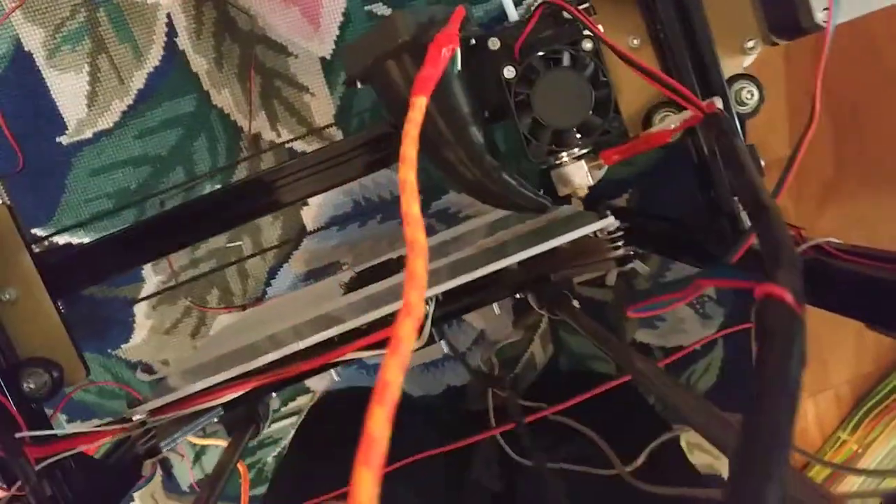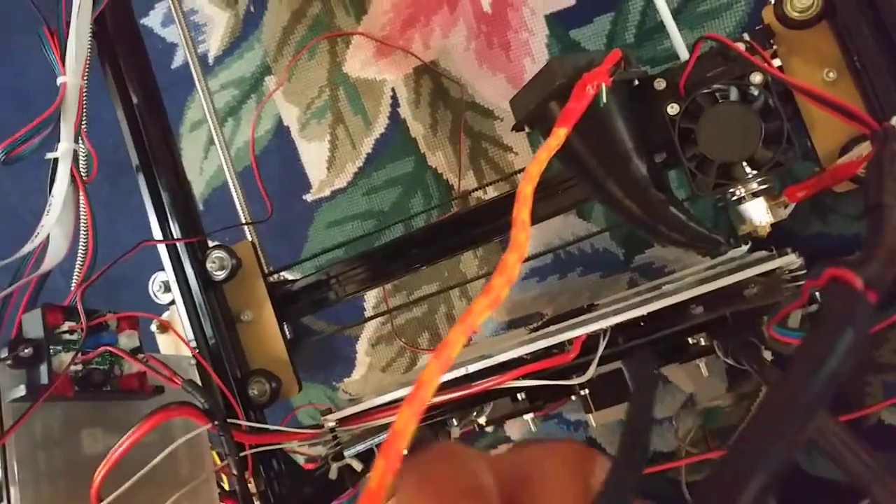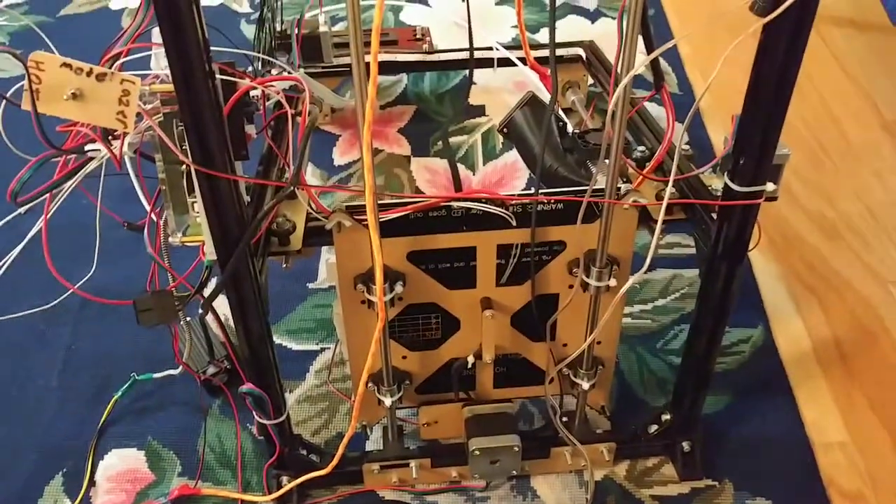When the Y-axis belt — I think it got jammed in the tensioner somehow, because I'm kind of troubleshooting now. Yeah, it's very jammed in the tensioner, I can't pull it through. So it somehow got jammed while printing, and the Y-axis stopped moving and made these awful sounds, and then it pulled one of the zip ties out and jumped across the printer, and then it stopped moving.